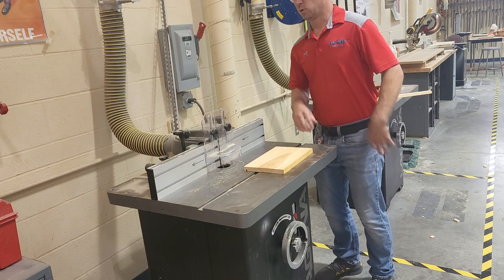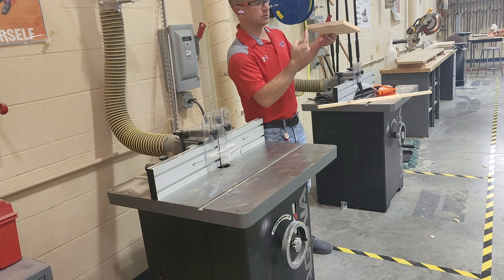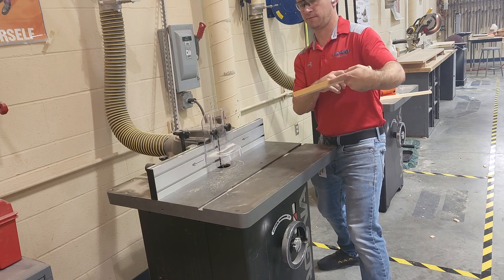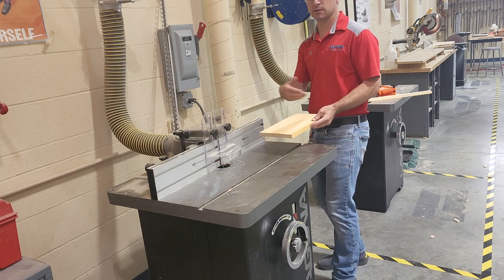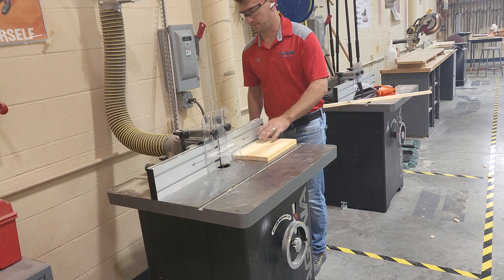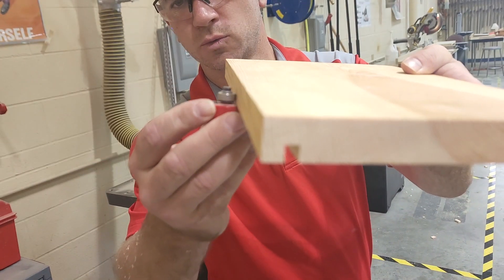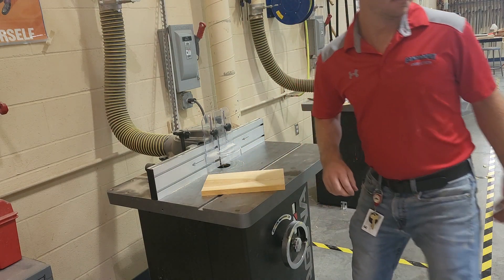You are not stagnant — you don't have to stay in one spot when feeding boards in. Make sure to follow the arrows. The blade is spinning this way; if we go the opposite direction and feed the board the wrong way, it would catch and push it away from the fence. If we're on the correct side, it pulls against the fence. On the other side, it pushes away — won't be as safe and won't make a good cut. On this setup over here, there's a bearing, and we need to make sure our board rolls against that to ensure full depth of cut.